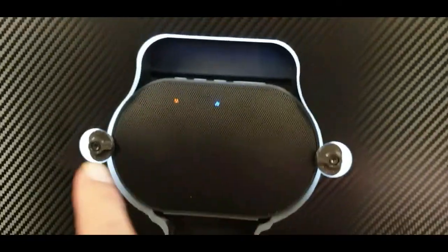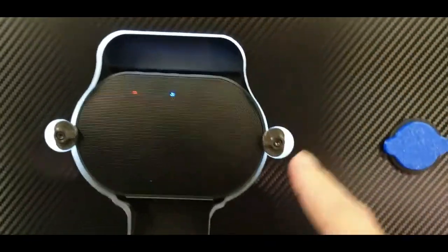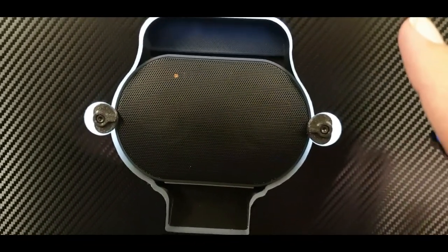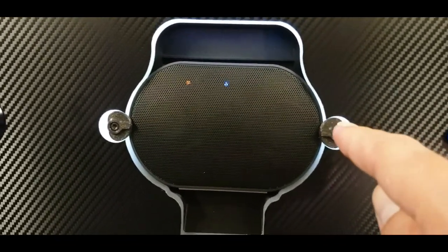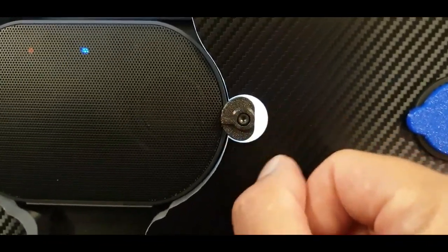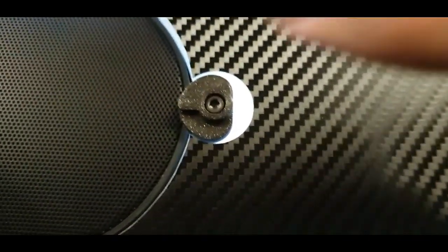Now going back to the beginning of the video, this is the holding bit that I was talking about. Originally I thought about having some form of O-ring going around with some little standoffs, and I thought, okay, that would look all right, but not brilliant. When this design came to me, basically I took the upper deck off today, mounted it back on the CNC, and then routed out a 21 millimeter circle with a 2.5 mil hole in the middle to about 2.5 mil depth, and then designed these little 3D printed, I'll call them cams, because they are essentially. So one side is straight and the other side is semi-circular, and then I've put the little tab there.